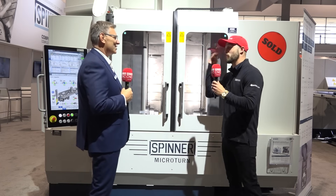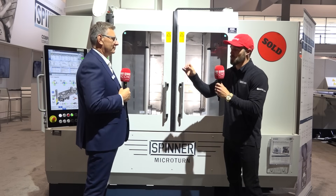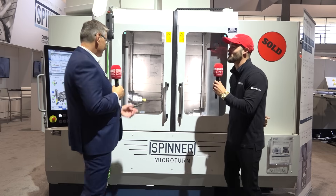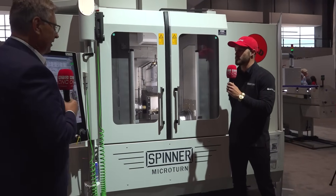Now aside from that, I know that the brains behind all the muscle is the controller. Let's dive into that a little bit because I understand there's a little bit of uniqueness there. This is the Siemens control. One thing that you notice — it's large, it's a flat screen — it's the Spinner Touch Panel 4.0. You've got your digital readout, it's a triple channel programming system, so you've got three programs that are synced together making this particular part. You've got the jog buttons and coolant and chip conveyor on and off. This is a really nice screen of the tool changer on top of the machine, so you can see the status of that anytime.